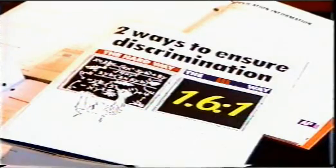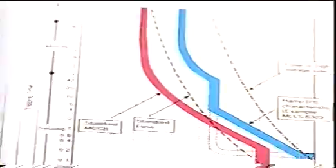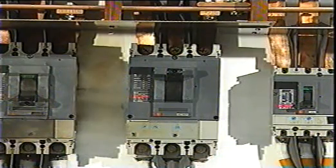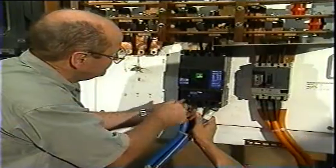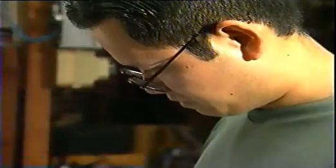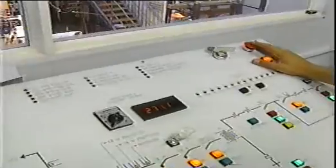As well as verifying specifications, a range of more general claims and counterclaims were also tested in the process, with a focus on crucial considerations such as operational consistency, protection of associated equipment, operating speed, let-through levels and operator safety. To begin the tests, various brands of MCCBs were selected, with a rated interrupting capacity equal to or greater than 63 kA. Because MCCBs are designed for simple resetting after each fault interruption, resistance measurements were recorded before and after every test to measure any contact deterioration. All the tests were filmed, so the results could be visually displayed and verified.